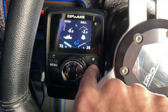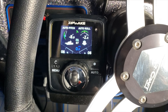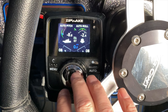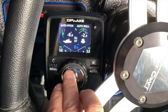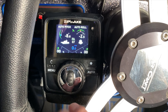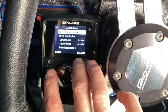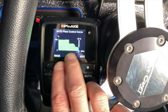All you have to do is push the auto button and it enables auto pitch and auto roll. There's a gyro in here that monitors the leveling of your boat and makes adjustments based on that. You can fine-tune those adjustments — override what it has by a few increments, plus four or plus eight either way. On the back end in auto setup, there's also a pitch curve where for every mile-per-hour increment you can fine-tune the level of deployment for the best ride possible.